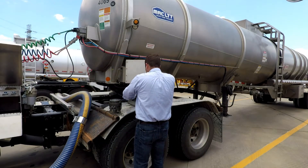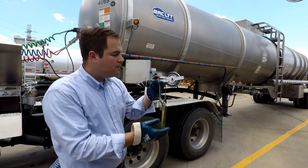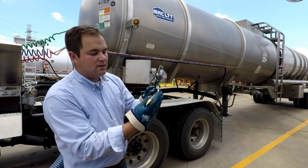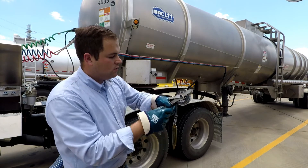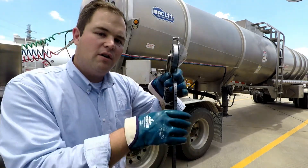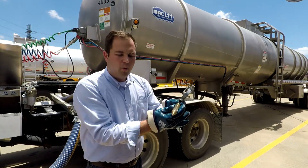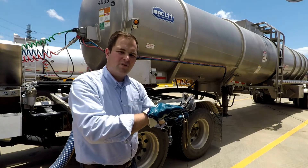We have our gauge tape with our plumb bob, and we also have the grounding strap with it. You have to have this to clip onto the tank to relieve any static electricity in the gauge tape. Make sure that the plumb bob is pointed correctly — if it's really rounded over, that's going to throw off your readings. You also want to make sure that your markings are clear, because after years of wiping them off, those markings will go away and make it very difficult to get an accurate reading. Look at all three parts: ground strap, plumb bob in good condition and pointed, and legible clear markings on the tape itself. Also look out for any kinks or bends, as those will throw off the measurements as well.